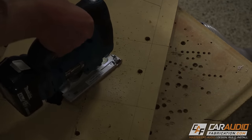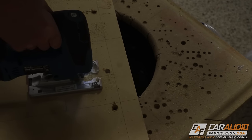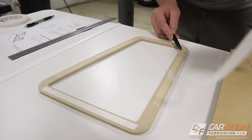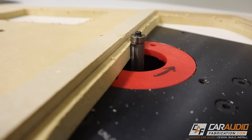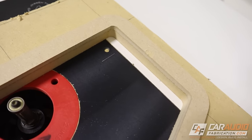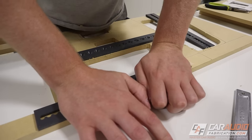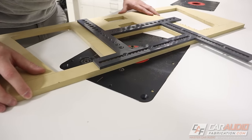In order to make my cuts perfectly straight, I'll be following up with a router. Right now I'm only using the jigsaw to do what's called rough cutting. If you don't have a router, you could use the jigsaw to carefully cut exactly on the line, but in my case I'm just leaving a little bit of extra material. The router process involves using double-sided sticky tape to stick my template to my work piece, and then on the router I'm using a flush trim bit to perfectly copy that profile to the new piece. I repeat this router process several times — it gives me much cleaner, straighter lines without any follow-up sanding.